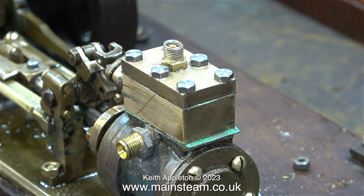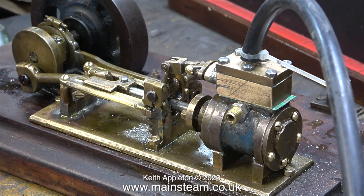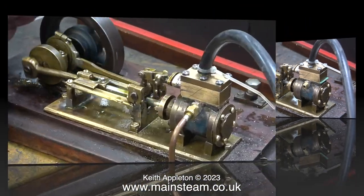I did that on two of the holes, and the others were slightly enlarged to a drill size above, just because it didn't fit well in the first place. Here's the finished job — the steam chest and cover are now held in place securely with six brand new 4BA hexagon head bolts. I've reconnected the air line and just need to turn on the compressed air.